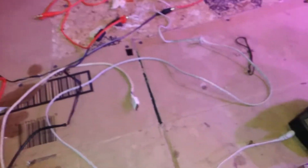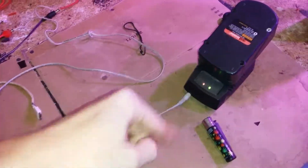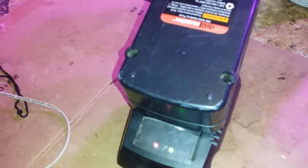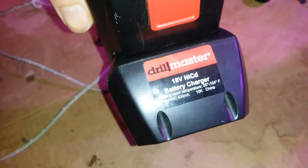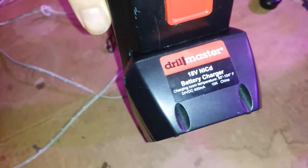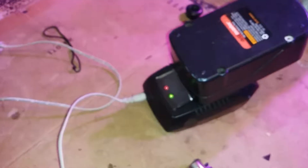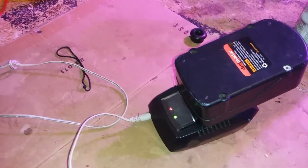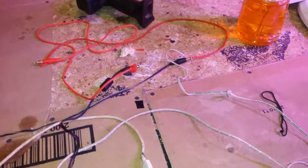You can see it runs through the cable. Put down and in. And this charger — 18 volt nickel cadmium — it takes input 24 volt DC at 400 mA, which is way, way, way lower than what I have going into it. But it does work. So that's how you do two 12 volts in series and get 24 volt output DC.